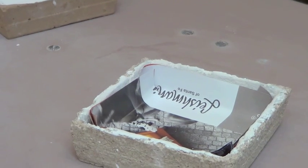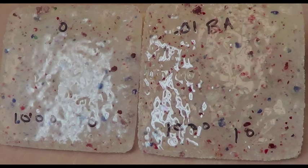Making your molds with a 5% draft also helps. I have found that boric acid works as a flux on borosilicate but at much higher temperatures than are required for soda lime glass. I fused these two tiles at 1832 degrees Fahrenheit.